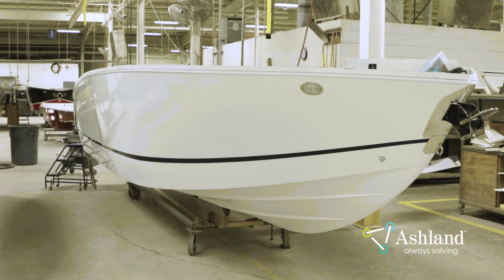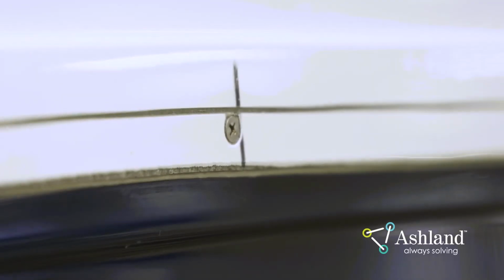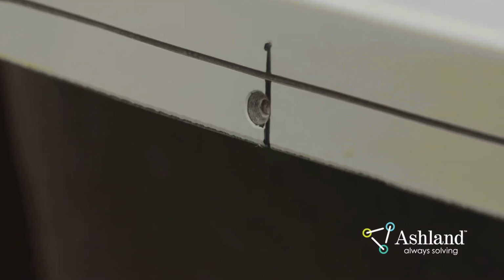Thermal cracking. Scribing and countersinking are done to reduce the propagation of cracks from fasteners. A metal screw is a poor insulator and has a thermal conductivity much greater than the composite laminate. As a result of thermal cycle exposure, the metal experiences a more rapid change in temperature, which leads to a higher rate of expansion and contraction relative to the composite material.